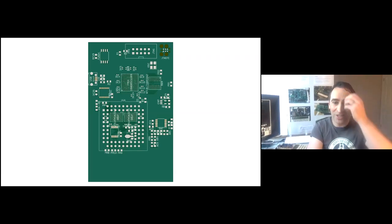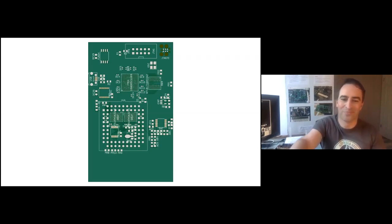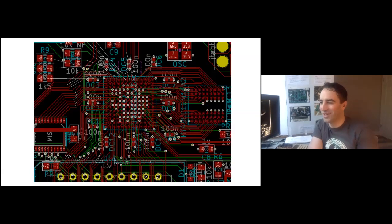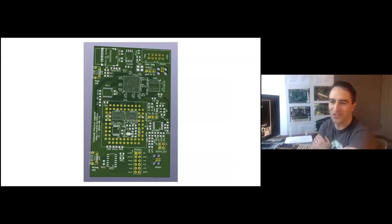After a bit more work, I had something that started to look like a circuit board. I posted this picture and got some interesting comments on Stardot — people realized how terrible this was going to be to solder at home. Here's a close-up of the FPGA and the SDRAM. The SDRAM is the thing on the right and you can see the ULA socket down the bottom. This was my second time working with these design rules. You can see you could fit four traces in between every pair of pins on the ULA, which I was sure would create horrible crosstalk, but miraculously seemed to work okay.